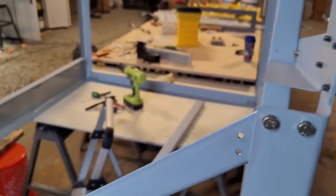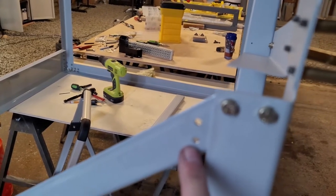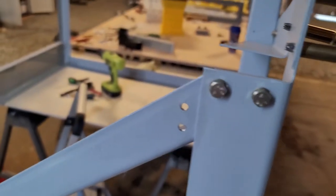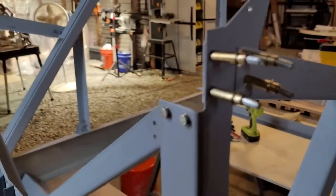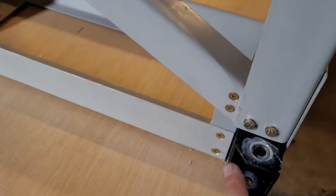There's a brace that goes here that the primer is still drying, and I don't really want to put that on until I get the motor mount in anyway, so it's basically waiting for primer to dry and having all the right size bolts. Probably towards the end of the week I'll actually get those motor mounts in, depending on how much time I have. All the motor mounts are fabricated from aluminum blocks — all those slats in the front, the little braces that go on there. These braces down here are all fabricated, and they're pretty complicated.